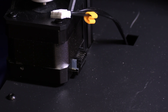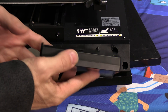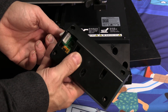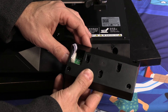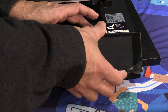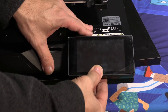If you move your eyes to the other side of the printer, you will see the exact same connection on the other stepper motor. Next, we will install our screen. Simply take the screen, flip it over, and connect the harness to the white connector inside the screen. It is notched and only fits one way. With the harness installed, tilt the screen, slide it over to three notches, place your thumbs on top of the screen and your fingers under the printer itself, and lock it down. Your screen will be firmly in place.